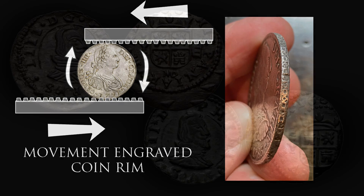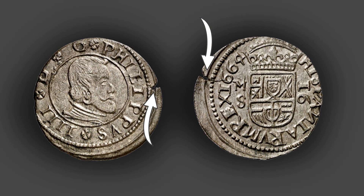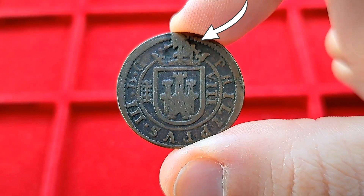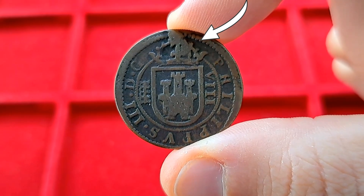Of course, these first minting techniques had some flaws. The most common was the misalignment between the obverse and reverse dies — the end result would be that on one side you would have a perfect design, while on the reverse part of the design would be out of the flan. In some more egregious cases, like this one I'm showing, the dies were so misaligned that you could even see the design of the next coin showing up. The cutting process of the metal sheets was also not always flawless — sometimes a cutting tool that needed sharpening, or an uncalibrated machine, caused tears on the finished coin. Also, sometimes the dies were placed too close together, resulting in the eventual clogging of some parts of the design. As you can see on the crown in this piece, it has this flaw which may have been excess material stuck on the rolling die.